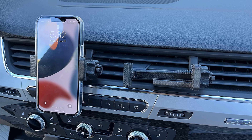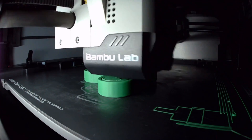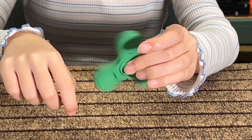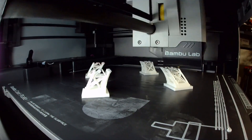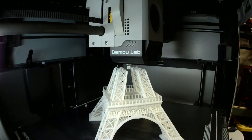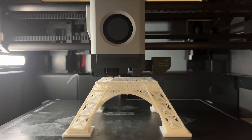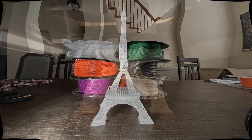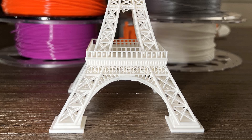However, you cannot print everything at this speed. When printing PLA, you can print most models at 300mm per second or faster and the print would still be pretty accurate. But when you print something like this Eiffel Tower, as this model requires a big amount of retraction, the nozzle clogged even when printing with PLA. I can't print this model unless I slow it down to 50mm per second. It just prints okay — not the best or worst tower I have ever printed, but at least better than the stock Ender-3, Ender-5, and most other Bowden setup printers.